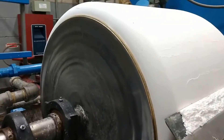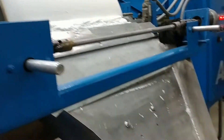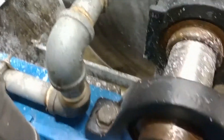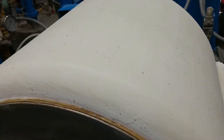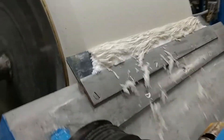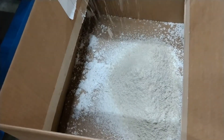We're going to be beginning the filtration process, bringing the wastewater over into the pan here. There'll be level control sensors to gauge as it fills up, and the solids are going to be coming out so dry it'll be going right into a cardboard box. The wastewater is beginning to fill into the pan — this is wastewater that's simply been treated with pH and ORP adjustment. The drum is rotating with the cake inside. You can see solids accumulating on the drum surface, and coming off the knife blade, which is advancing slowly because the solids aren't very high. Those solids are just slightly dropping off into the cardboard box, ultimately a dumpster.